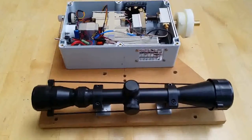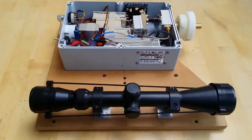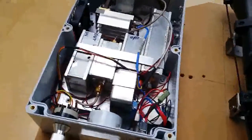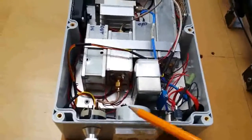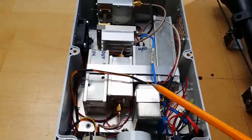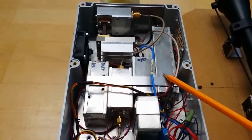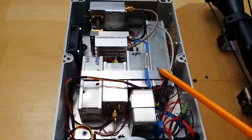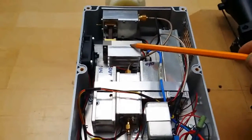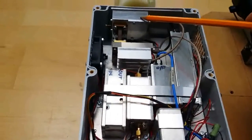This is the 241 gigahertz receiving system — the same basic concept as the transmitter, with the sighting telescope and receiver side by side on the baseboard for fitting to the tripod. The parts are laid out slightly differently: we have the reference OCXO at 10 megahertz, the synthesizer feeding into a times-5 multiplier, which connects across to the Toshiba 40 gigahertz stage, driving into the diode mixer.